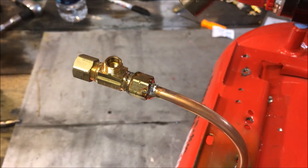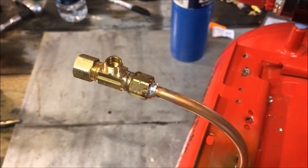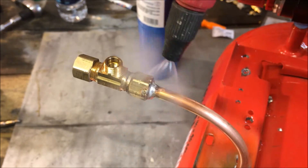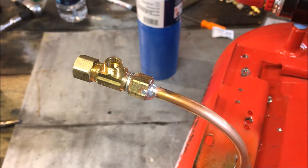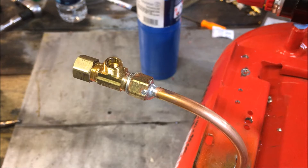The reason why I didn't just do a standard compression fitting on this is because, after using this stuff for so many years, I've come to the conclusion that it's just not good for anything over 30-some PSI. They leak damn near no matter what you do, and it just gets old — putting a bunch of machinery together and then tightening up four or five of these things. That gets to be a real pain, especially when you're pumping caustic solutions or stuff like that. So I just solder them anymore. Especially if it's a gas.